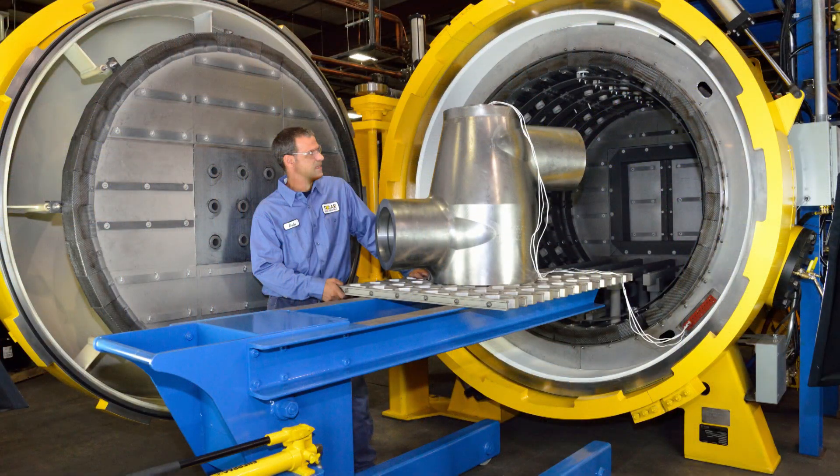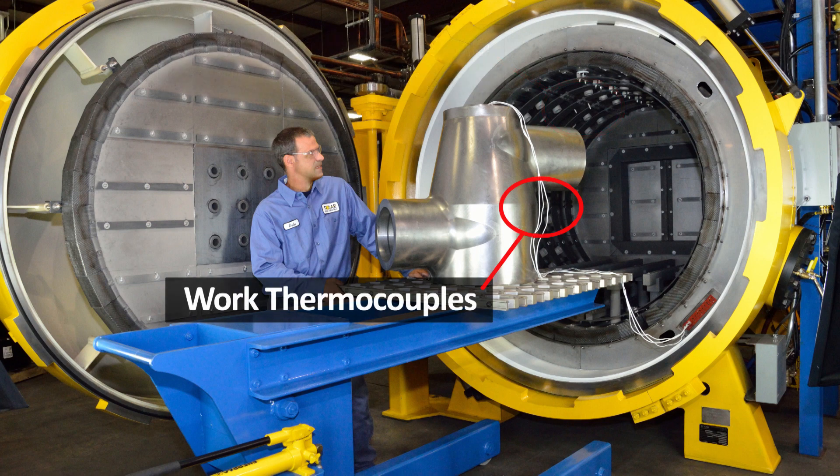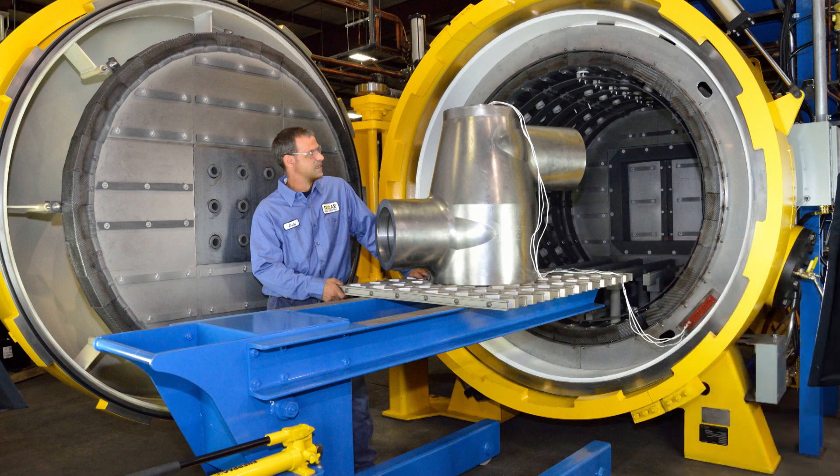During the next couple of slides I'm going to discuss thermocouples, or as we say, TCs — see the circle in red in this picture. You have control and over-temp thermocouples in the ceiling of the furnace, and part thermocouples are attached to the actual part itself. We call these work thermocouples, or work TCs, part TCs, or contact TCs. Basically, at the tip of these wires we are measuring the actual temperature of the part. Measuring actual part temperature is very important in having a successful stress relief process.